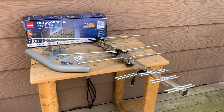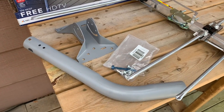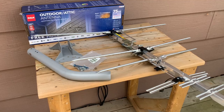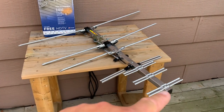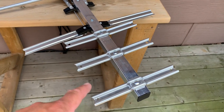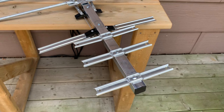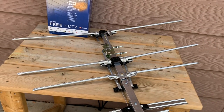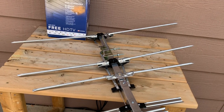Like other versions of this antenna, it comes with a mounting arm — the exact kind you'd find with any satellite dish — along with all the included hardware. Size-wise, this would be considered a small to medium outdoor antenna; the boom measures 31 inches long and the widest elements at the back are 34 inches. The smaller elements on the front are known as directors, which direct the signal to the elements that capture UHF TV stations broadcasting on RF channels 14 to 36. The longer elements at the back are for VHF channels 7 through 13, which transmit on much longer wavelengths and therefore require longer elements.